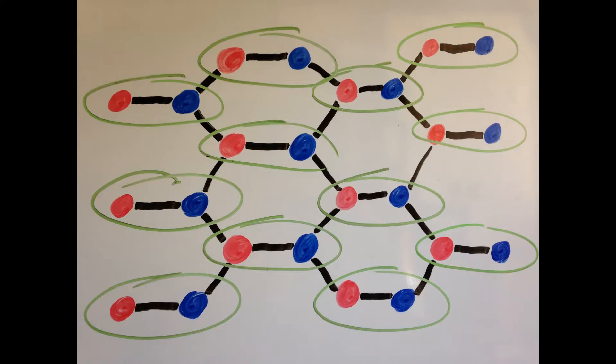The sensor itself is a piezoelectric crystal. A crystal is anything that has a repeated atomic pattern — you have a few atoms in the same position and repeat that same arrangement next to it, over and over again. A piezoelectric crystal, like what's in this little black disc here, is actually made of electric dipoles. The repeat unit is made of very small electric dipoles, so you have lots and lots of very small electric dipoles.